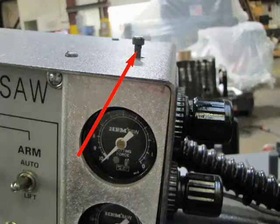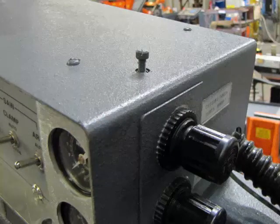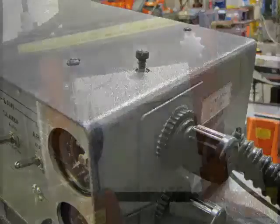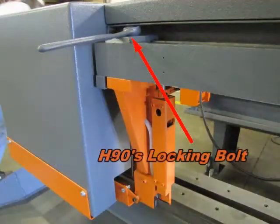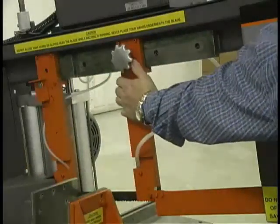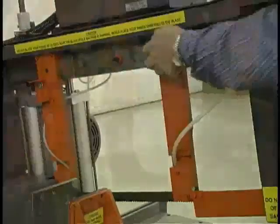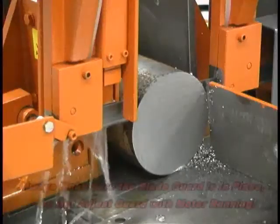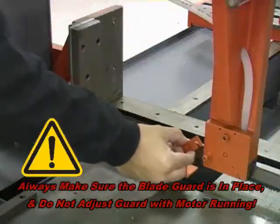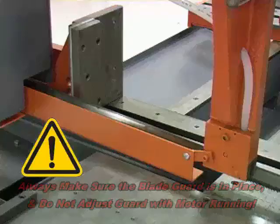The air bypass valve must be opened slightly to allow air flow through the system. If the screw valve is closed and air does not pass through, operations like arm descent will be jerky. The adjustable guide arm can be moved by loosening the locking knob on the back side of the Sidewinder model or by loosening the locking bolt on the front side of the H90 model. Then the guide arm is adjusted by pushing or pulling it to the desired position by hand and tightening the locking knob or bolt. In general, the guide arm should be as close to the material as possible without allowing the guide arm to make contact with it. For safety, always be sure the sliding blade guard that attaches to the adjustable guide arm is in place before operating the saw.